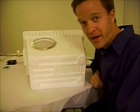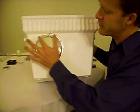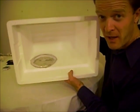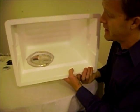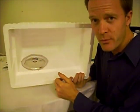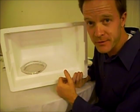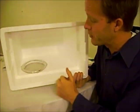I've got the first window done now. As you can see, I've used the foil tape around the outside edge — outside and inside — so it is two panes thick, great for insulation. Something to be aware of on the inside: if the seal on the inside is not real good, you may find some water will condense inside there, and because it's all sealed off it's hard to get out. So seal this inside portion really well.